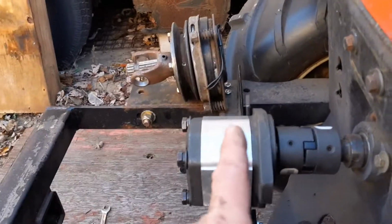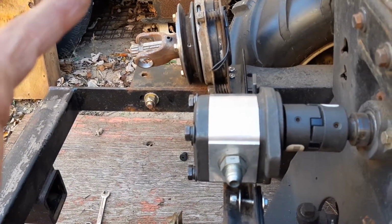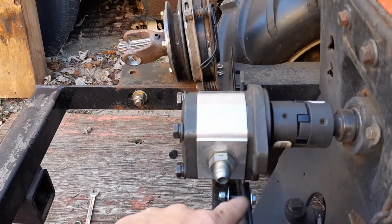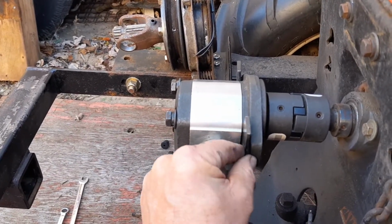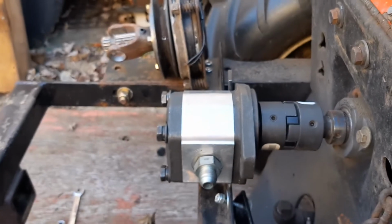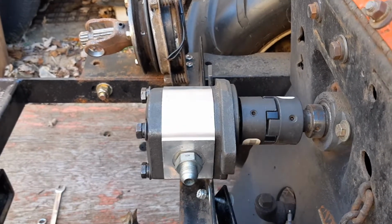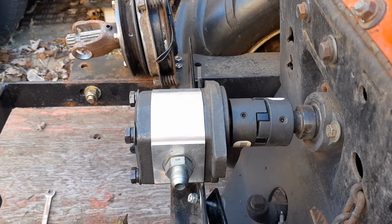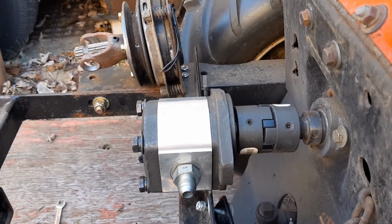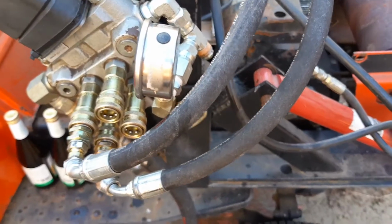That's what I'm doing. My next step is to put the tank back on, plumb everything back up, and turn it over, see how this thing's working. I still have to work with the brackets. The brackets off the old setup aren't quite in line, so I have to work with them. And then get this solidified, and hopefully the pump stays with the tractor, and it'll always be running, which my hydraulics guy said shouldn't be a problem at all. Even on startup, there's really no horsepower required for that. So there you go, update. I know a lot of you have been wondering, but wonder no more. Those are my next steps. And I might have these front cylinders pumping oil through there yet before the snow flies.